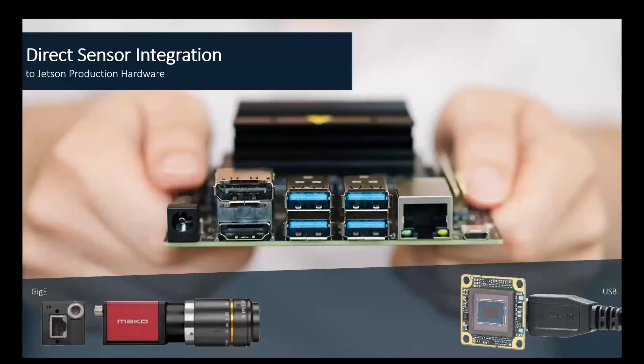We're now going to discuss the vision interfaces that allow for the simplest level of integration: GigE and USB. Both of these interfaces rely on the existing protocol standard and interfaces to ingest image data. These interfaces exist at an application level, meaning you're likely not dealing with low-level hardware configuration or kernel modification. So as long as your carrier board has a USB or Ethernet connector, the application level will accept the data. The main advantage is that it just works — no additional development is required to configure compatibility.